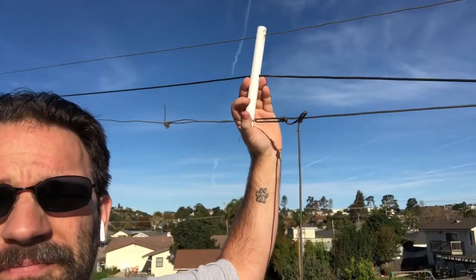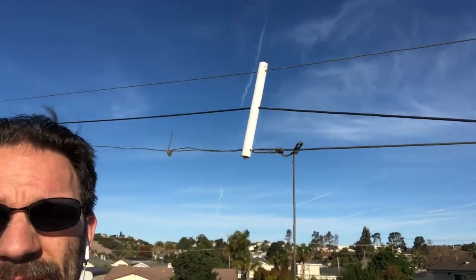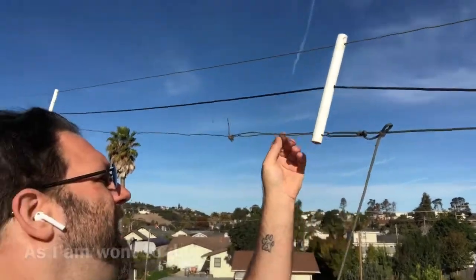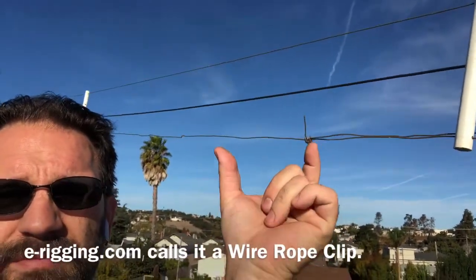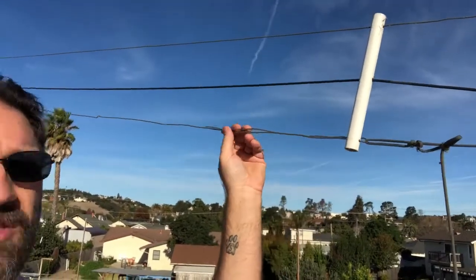You'll notice that this section right here is wire and this one right here is rope, and I joined them right at a separator. I looped one through the other — technically you could do this with an insulator if you wanted to be cleaner about it, but I went cheap and easy. The wire comes over here and stops, then loops back on itself and uses a little U-shaped bolt with a cast aluminum clamp on the other side to hold it in place. That allows me to adjust the tuning — I can move this in and out to make it longer or shorter to tune that leg of the antenna.